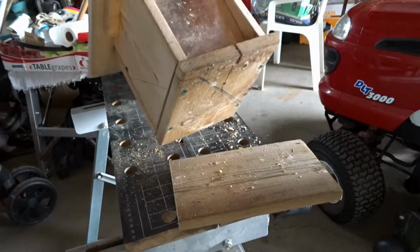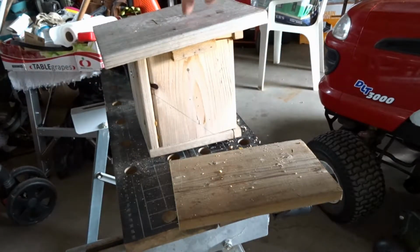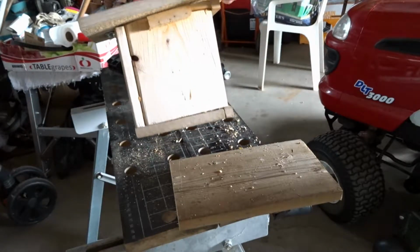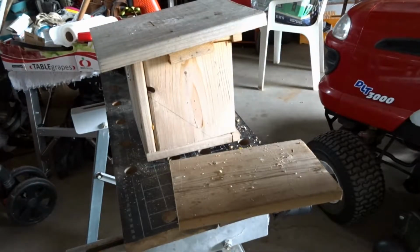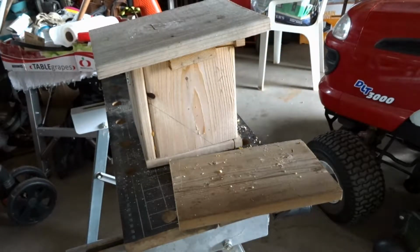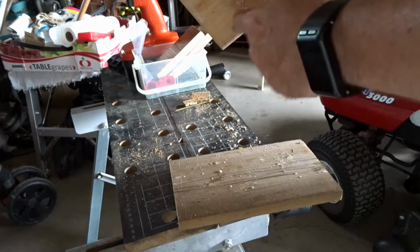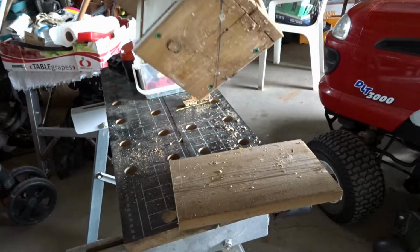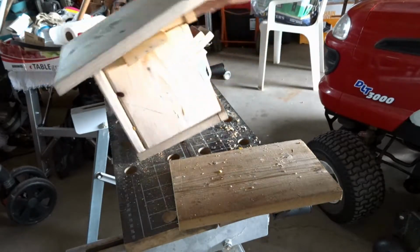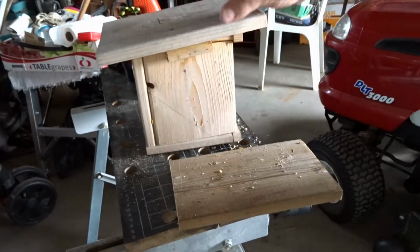This is basically a fence board. The top piece is a little bit bigger, a little heavier stuff, but it's made out of fence board. So you have to be careful, pre-drill stuff, and I'll show you how I do that. And also pre-drill the countersinks for the screws. Otherwise you'll end up splitting this wood. It's not very tough. But it's actually cedar, so it should last.